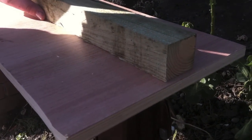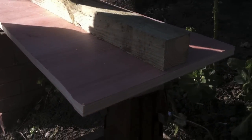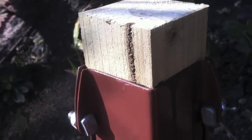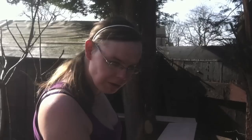Some of the others that are spanning a greater distance between brick piers I'll use two of these side by side. We've also got the three by three tonalised timber, which we've very carefully levelled using a long piece of batten and a spirit level to make sure that each one is locked back to the previous one on the levels, because model trains don't really like gradients. In fact, the only thing they like less than gradients is sudden changes in gradients, so really we're trying to make this all as level as possible.